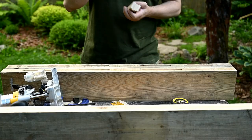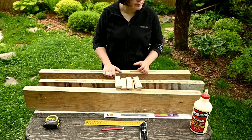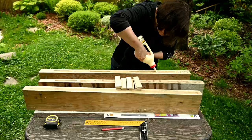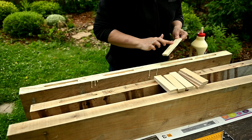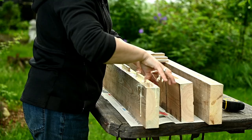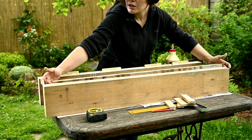After the slots are finished we connect them together. Here I'm coming in with wood glue — my favorite Titebond wood glue, which is great for gluing wood parts together. I'm applying it generously over the narrow side of the board and into the slots, then covering the plywood pieces with glue as well. I'm inserting the plywood pieces into the slots and placing the second board on top, pressing it so the plywood pieces get into the slots on the second board.